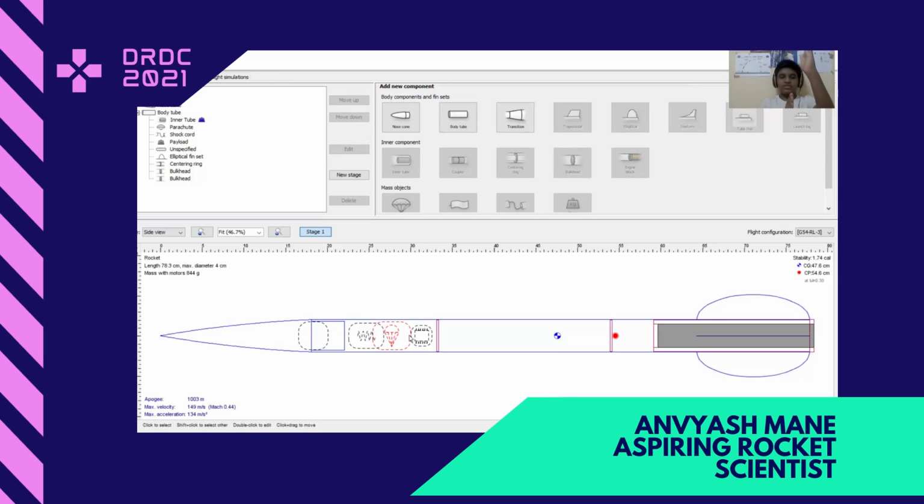Now the angle of attack. I'm talking about the recovery. It's coming slowly down, and what is happening is, you are 1 kilometer away from your launch site, your recovery device is deployed, and it's going to make it turn like this, toward the 10-meter diameter radius of the field where you launched. It's going to make the whole rocket turn like this, and the parachute too. So the angle of attack will be different, and it will be taken down to the 10-meter radius field.